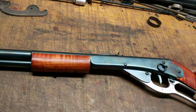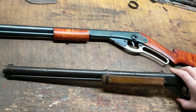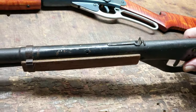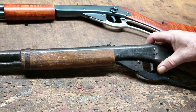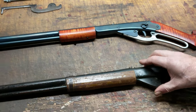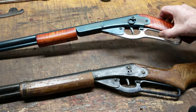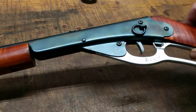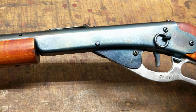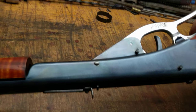What we've done on the metal work: when the gun showed up, it looked remarkably like the comparison gun — you'll see the blistered paint, the rust, the dings, the pings, all those things. So we did surface work on the metal to prepare it for a fire blue process, and on this gun the fire blue worked out really nicely. You can see some of the subtle shading variations — the deep blues, the slight purples, and light straws on both sides of the weapon.